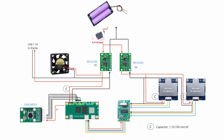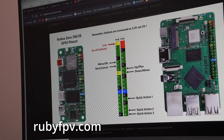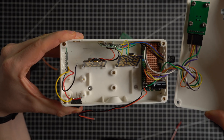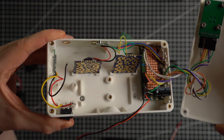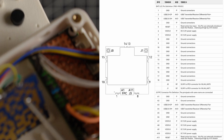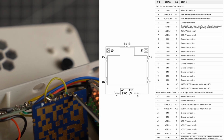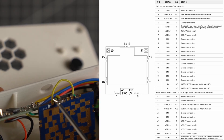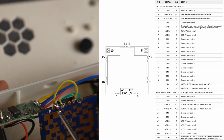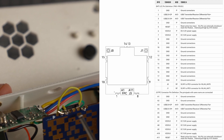The next step is to wire everything together. You can use this diagram as well as the information found on the Ruby website. Here you can see some of the components already installed and pre-wired. One thing you need to be careful about is connecting the Wi-Fi modules. On the pinout diagram the pins are numbered one to eight — pin eight is ground, while pins seven and six are 5-volt. Do not short these two, or you will break the board.